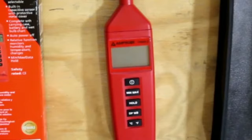This meter can be used up to 2,000 meters in elevation, which is about 6,561 feet from sea level — so if you're on top of the Rocky Mountains, this won't be your meter, but most of us aren't. Operating conditions are from 0 to 40 degrees Celsius (32 to 104°F), so it's not for real low-temp applications — mostly HVAC. The temperature range of the sensor itself is from negative 4 to 140 degrees Fahrenheit.